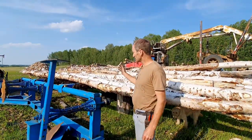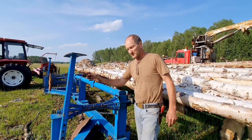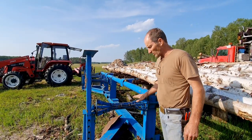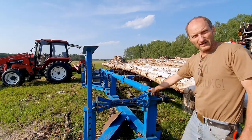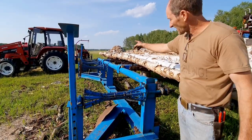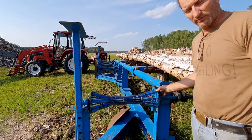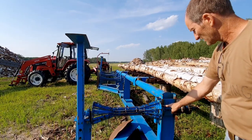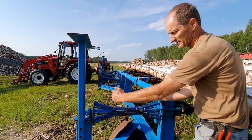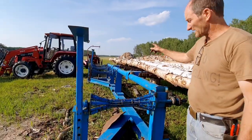So we made a few changes to how this firewood processor is set up. Lots of guys, if you've watched me before, you know that I have this forwarding table, but I added a second bearing on the front and the back. I actually broke the hourglass roller last year — made a video of it that I haven't posted yet — because there's so much pounding on this shaft. So we put a second bearing so that this is supported better on both ends. And then we'll go to the end over here.